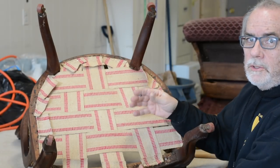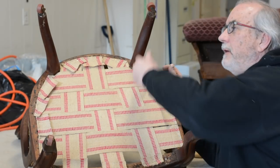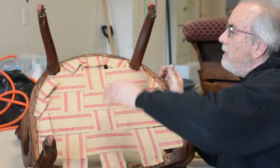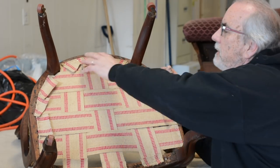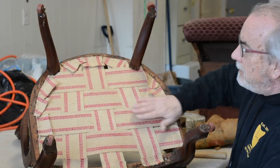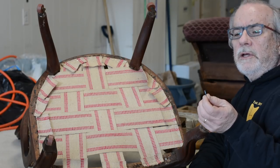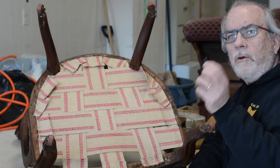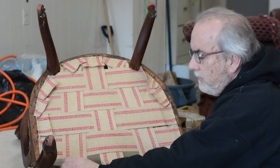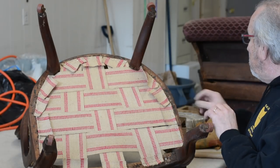To review on the webbing: always start on your back rail — the strongest rail. Drape the webbing over, don't pre-cut. We did three webbings back to front, then four side webbings woven with alternating weave. If a chair isn't in good shape and you feel the staples won't hold well, you can take a 14-ounce tack at each webbing stripe to help support the seat. This chair didn't need it.